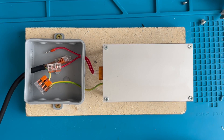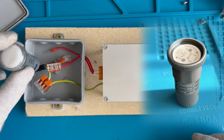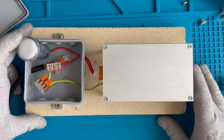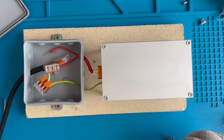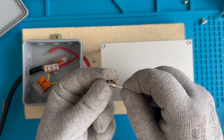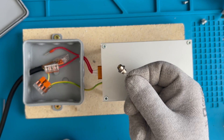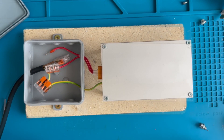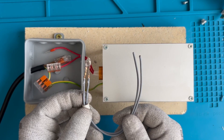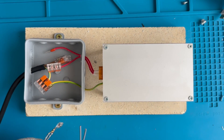But we have some improvements left. We should add a small lamp to show when it's turned on. Modern lamps are just glorified LEDs with a huge resistor — they are also way too long, so we can't easily install them. Can we replace it with a DIY version? We get back to the original problem: what happens when it fails? That's why the store-bought LED lamps are so long — for safety. So instead of tinkering, I got a neon lamp, or glim lamp, because they look cool and can be directly used with line voltage.